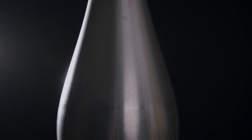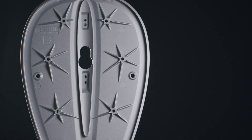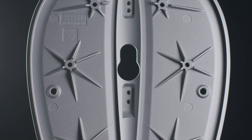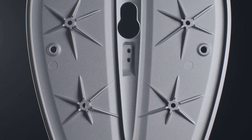We've also made significant advancements in the enclosures. Right next to me is the turbine head assembly — this is where the mid-range lives. Inside this turbine we have fins, and each fin is surrounded with a TMD, a Tuned Mass Dampener. These reduce the amount of resonance within the enclosure, resulting in clearer, more defined mid-range. Just below that is the interface top plate, which stiffens up the cabinetry for better coupling of the turbine head to the cabinet, and because it's solid aluminum, it makes the cabinet more inert — resulting in less cabinet resonance.